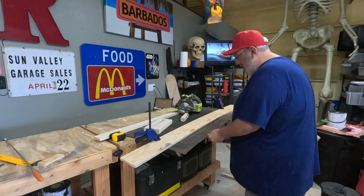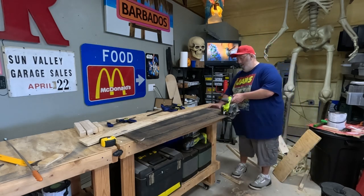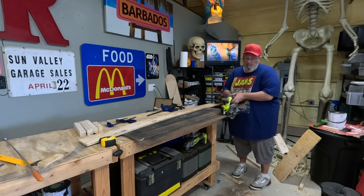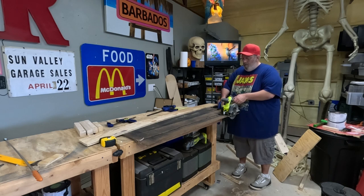All the ones I've seen use quarter inch plywood. You lay two layers, one on the bottom, one on the top, and you set a width that is the exact width of your circular saw so that you can use it as a guide. Essentially, you rest your saw on the lower piece and the blade hangs just over the edge of the lower piece of wood, and you're bumping the guide of the saw up against the upper piece.